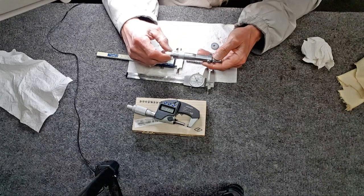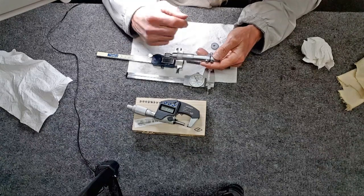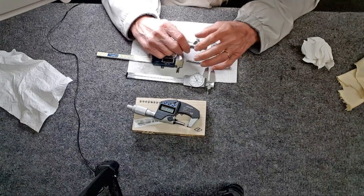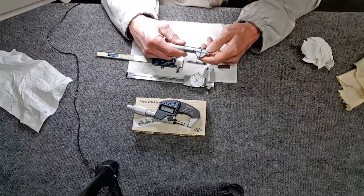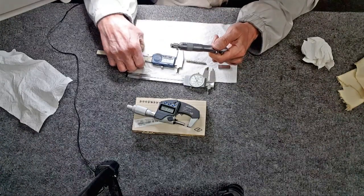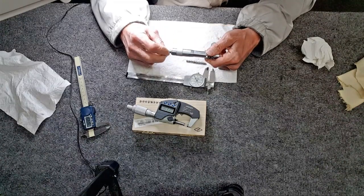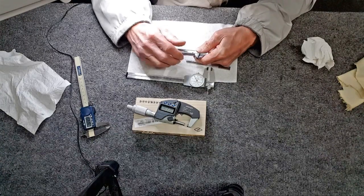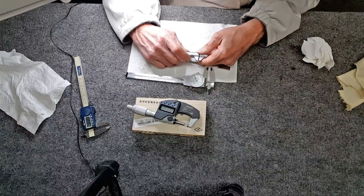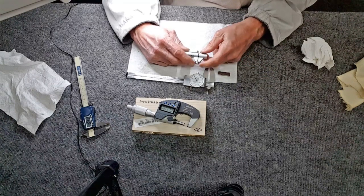To sum it up: I messed with this thing a lot. It's pretty good - cleaned it up, removed some blemishes, calibrated it to the five millimeter test gauge. You can see where the line is versus where it should be. I tried to take it apart to clean and refine it more, but couldn't get the double nuts apart - you'd need to make a special wrench to hold that lower nut. There's no way to lock the dial, which I wish you could. Pierre's Garage reviewed two of these from Banggood and did a fabulous job talking about these types of micrometers - I'll put a link in the description if I can find it.